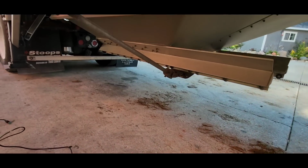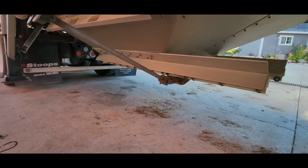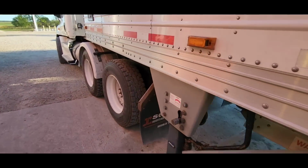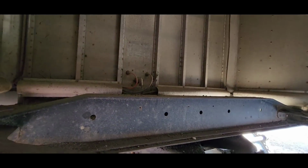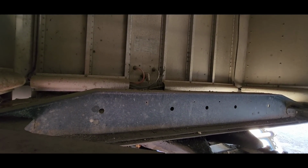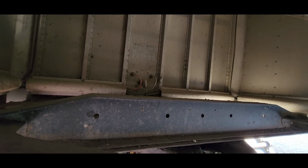The trick here is figuring out where do we have power on the trailer, and where do we got to run wires to steal power, I guess. So when I did that other one, I believe there was a power wire up there in the front. There was like accessory power or something. So I need to crawl up there and test that. We need to get a test light out and see what we can find and figure out where to steal power from.